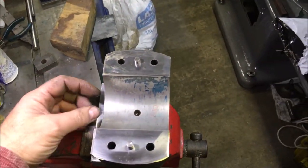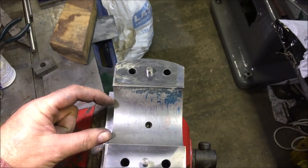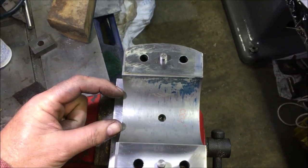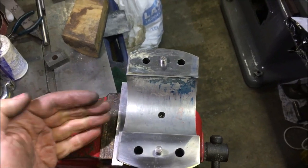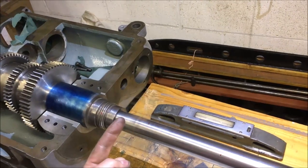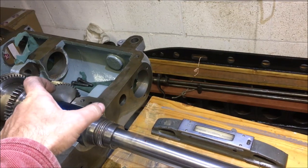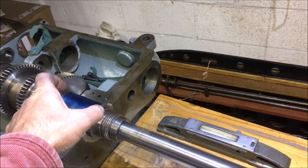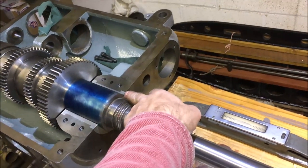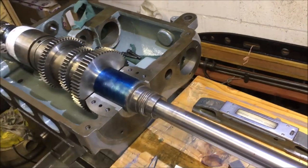something in the region of a contact full width and somewhere around sort of half of that distance there, so maybe sort of across there, so that as the tool pressure is pushing in, that shaft's going to be pushed up. I want it to actually be pushed up into the point of the oil wedge that's being created, and the oil wedge should sit somewhere in the region of about half an inch to 3/4 of an inch above the joint line. That's my understanding of it.